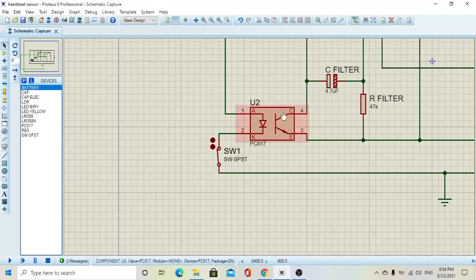Right here we have the IR LED and the photodiode receiver. These two are connected in one package together. If we connect direct current to the IR LED, that means the IR LED will transmit infrared light to the photodiode directly. So we must connect a switch to the IR LED to control the transmission of infrared light from the IR LED to the photodiode receiver.